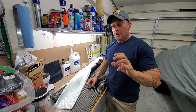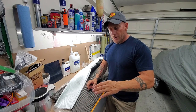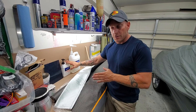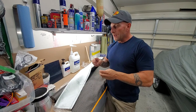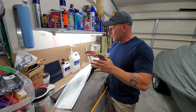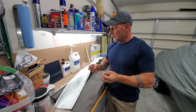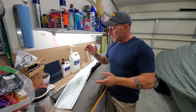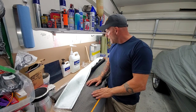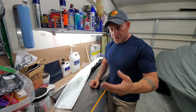The second most important thing when working with epoxy: don't mix a lot of resin. If you mix too much resin and let it sit in your cup, don't walk away from it — especially don't leave it in the shop on a table after your layout, because it generates a lot of heat. If you mix your batch a little too hot, meaning a little too much hardener, it can spontaneously combust. It doesn't happen often but it can happen. Wear your gloves and a respirator — the epoxy doesn't smell too bad but the chemical reaction generates a lot of heat. Don't get it on your hands, it's very strong and very hard to get off.